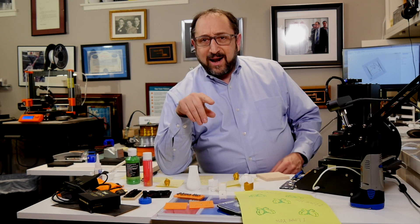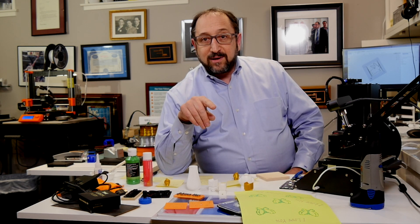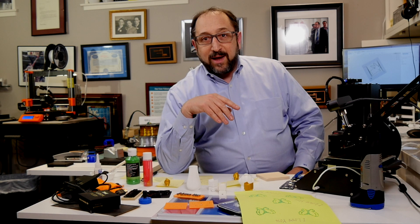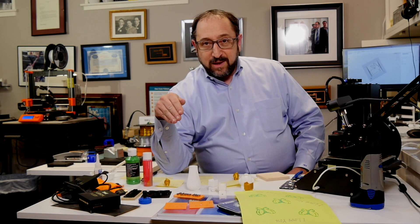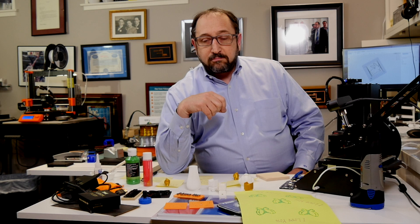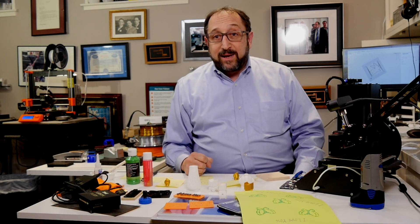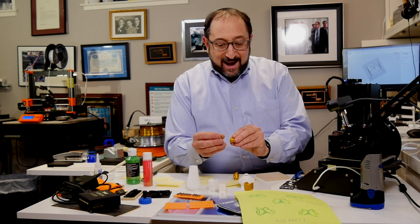I went to print and stopped right away, then started an XYZ calibration and walked away. Mistake. They tell you to put a sheet of paper to watch it — if it hits the sheet of paper and the paper gets stuck, you need to stop it immediately. I walked away, and when I came back my brand new Ruby nozzle — about a hundred bucks — was grinding on the print bed. In the rightmost corner it had ground off some of the black paint, with brass showing underneath. I readjusted my proximity sensor, which was too high, and recalibrated again. Everything seemed fine, but my Marvins came out terrible.